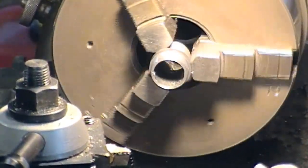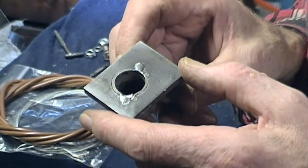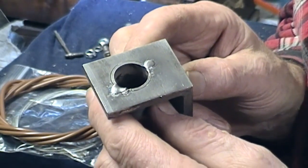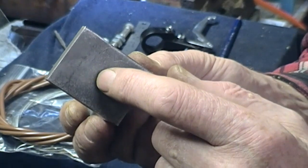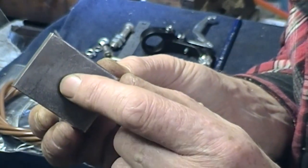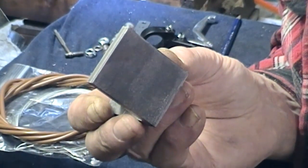Okay, let's see what we can do with that. When I got that pressed in it wasn't quite as tight as I wanted, so I just put two little weld beads on the edge, opposite sides. It's not going to go anywhere and there's very little stress on it. So what we've got to do now is drill a hole in this base section and choose the best position. It may not be quite on centre because there may be a slight shift due to things that might be in the way. So we'll get on with that and hopefully get closer to getting the cable sorted out.